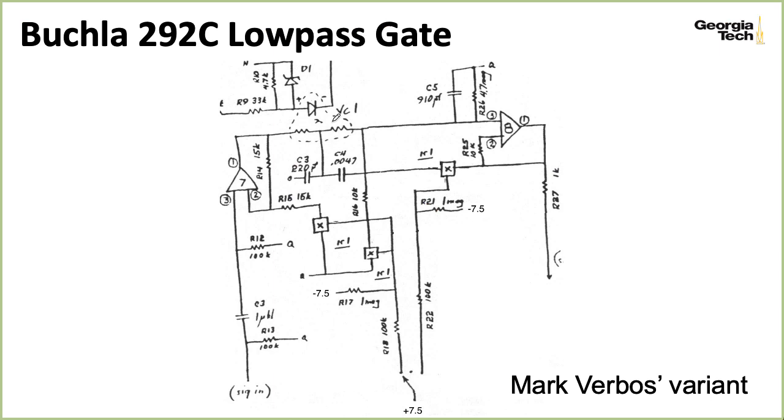In the upper left-hand corner you see a little bit of the circuitry that generates the current for the light-emitting diode—I'm not going to worry about the details of that here. The signal comes in over here, the signal comes out over here, and we have various mode-switching mechanisms down here, essentially creating voltages that control these electronic CMOS switches.